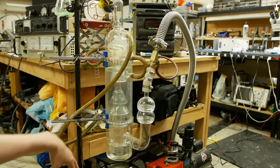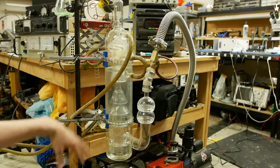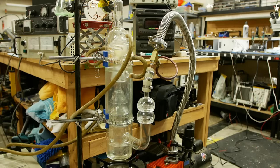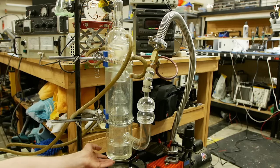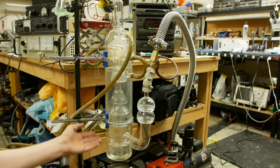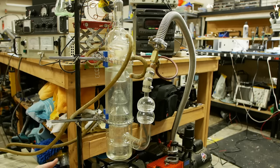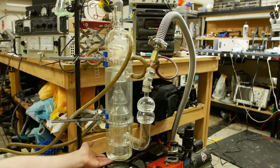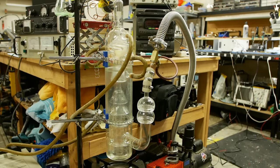They're deceptively simple — there are no moving parts on the inside. All the work is done entirely by these moving vapor molecules of this special fluid. In the early days they actually used mercury, because it has a really convenient boiling point and mercury is heavy, so you want something fairly massive to push those gas molecules out of the way. Obviously boiling mercury is not so great, so nowadays we use either silicone oil or hydrocarbon oil that has a boiling point that's just about right.